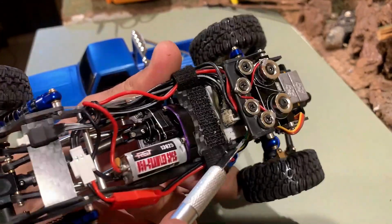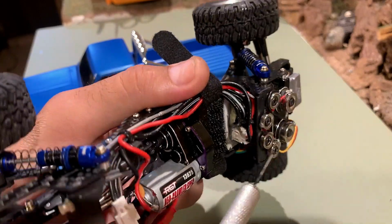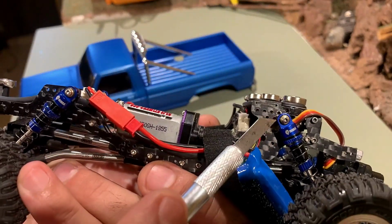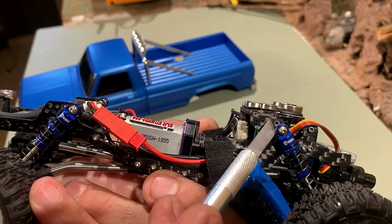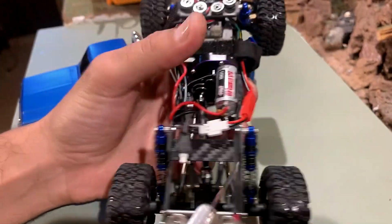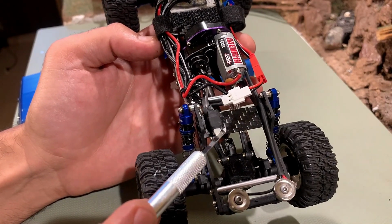Also, I discovered that these carbon plates were conductive of electric current, which short-circuited my lighting. That is why I insulated it in a heat-shrinkable sheath. I filed the carbon sheet at the front to make an opening for the passage of the cables, soldered to the magnets for the connection in the ESC. And then I glued the on-off switch to the back.